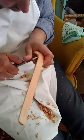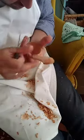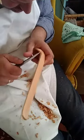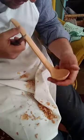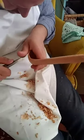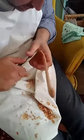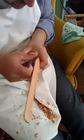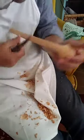And having a good hook knife, right? I use the Monadnock from Matt White, Temple Mountain Woodcraft, and I know exactly how deep I can go with it. I back off before I start getting those chatter marks, and I don't get those chatter marks as soon as you probably do because I'm stropping. So it's a combination of all of those things.